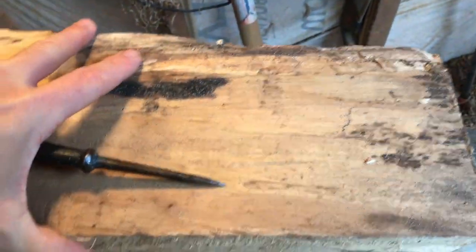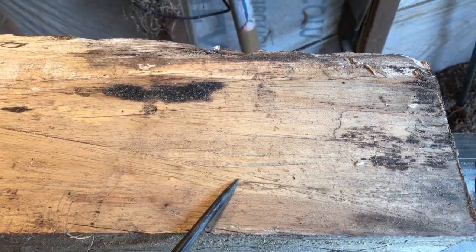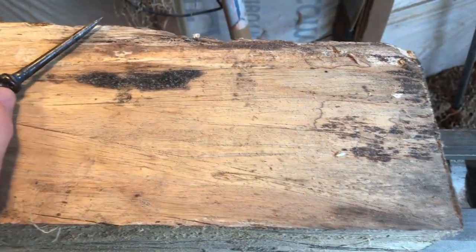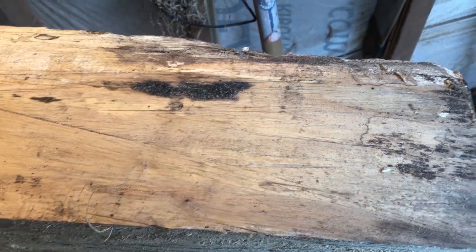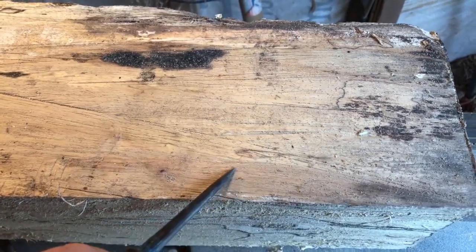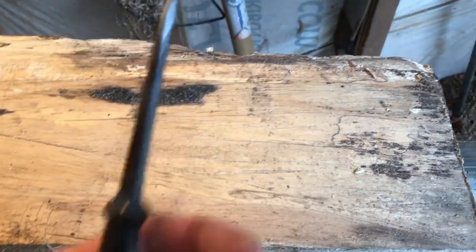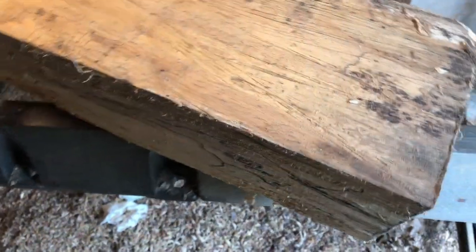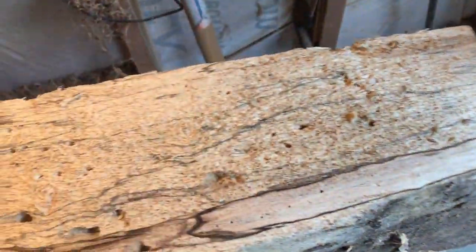There are some softer areas up top, so it's going to be a small piece. As long as you get a lot of the really punky stuff out, the turning of it is going to be much like anything else, except it's going to be a lot softer — like turning soft basswood or tupelo. The biggest issues come more in sanding. It's really easy to sand depressions in spalted areas, particularly the more it's spalted, so you can get surface variations. As long as your material is dry and it's not real spongy, sanding is going to be the biggest issue. If you're hollowing out, you might hit pockets where it's spalted and your cutter cuts more aggressively, so you can get areas in your walls that get thinner than others and you could blow out in those spots.